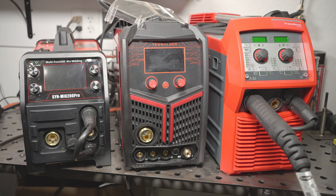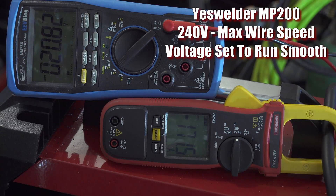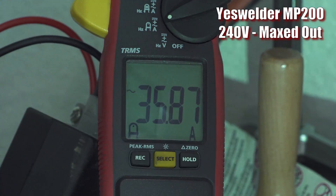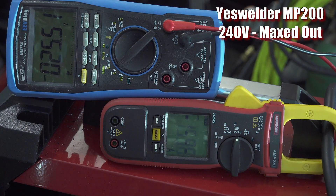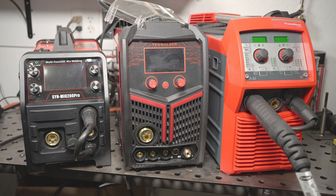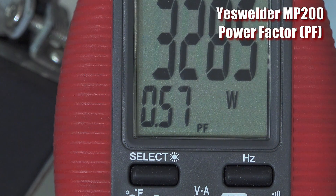Running on 240 volts is more of the same. With the wire feed speed maxed out, I was only able to get a little over 160 amps out of this machine. If I had the voltage set so that it would run smooth, it only provided about 3,200 watts of output, which is similar to what the Hitbox and Fronius did on 120 volts. If I maxed the voltage as well as the wire feed speed, it ran rough, but the wattage did increase to 4,000 watts or so. All this testing was done with 0.035 inch wire. Running as intended with the correct settings, I don't get anywhere near the 160 amps claimed on 120 volts or the 200 amps claimed on 240 volts. In terms of output wattage, the YesWelder lags well behind the other two. Power factor on the MP200 is around 0.6.